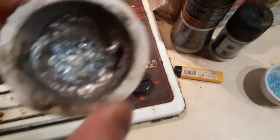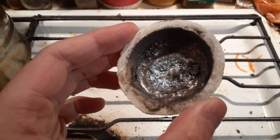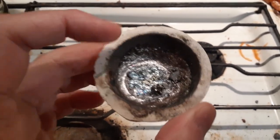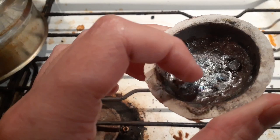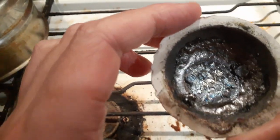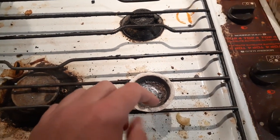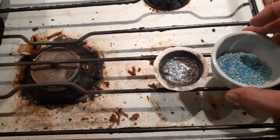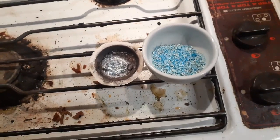To wrap things up, let's look at our final result. You can see the outer edges have that dark coppery color, because it probably is some kind of copper - fairly crude and impure, but it is what it is. In the middle and at the bottom, you have the lead, which has a kind of pearly, rainbow color for whatever reason. If you scrape it, it's just pure lead - it did not amalgamate at all. I could see it boiling - the copper boiling on top and lead boiling on the bottom. Even at high heat they did not merge or forge together. Maybe if I used a different method or more heat - I don't know enough about metals, hence why we're doing these experiments. Eventually I'll learn.